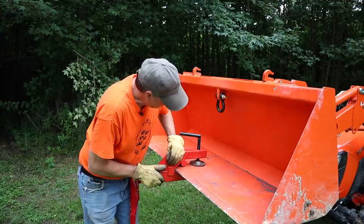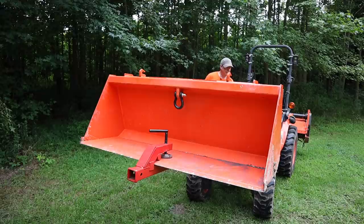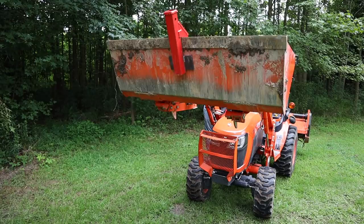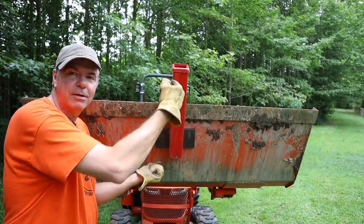Really nice. Let's take a look at the top and then I'll show you the bottom. So there's the bigger foot — the one it comes with is about an inch and a half, and this is four inches now, so I've got that much more surface area. When you use this hitch and put weight on the front, you're pulling down on it, which transfers all that weight back up here — it's acting like a fulcrum and pushing up against it. So by having this extra surface area you're really protecting the bottom of that bucket.